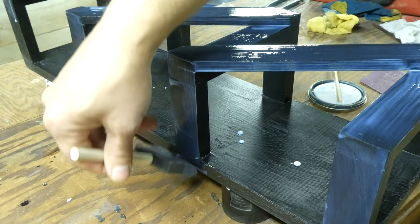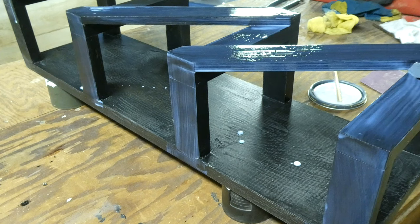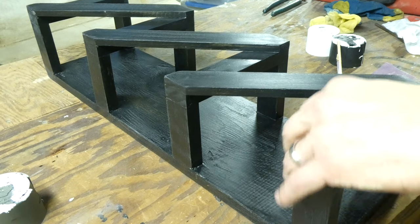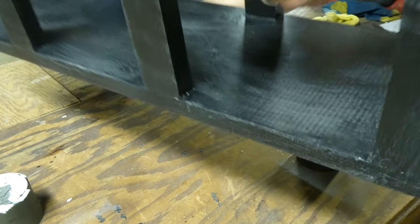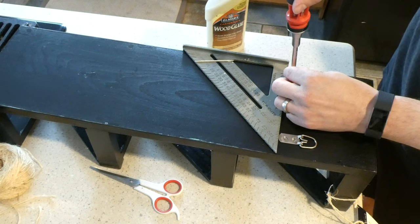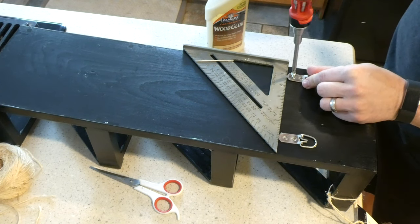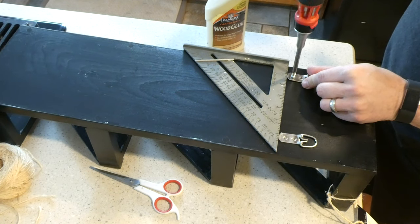After addressing the wood glue problem areas, I put on two coats of polyurethane to give it a protective finish. I went with a semi-gloss because that's what I had on hand. To help get a smooth finish, I sanded in between the coats of poly with 400 grit sandpaper and gave it a good wiping with the tack cloth. Last but not least, I put on some hanging hardware. I wanted to make sure my secret Santa recipient had plenty of options for placing this in her new house. I added some wood glue to the screw holes for added stability. We're now ready for the wine bottles.